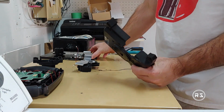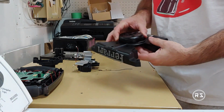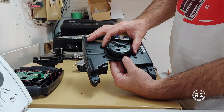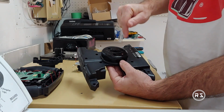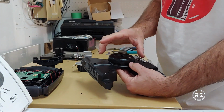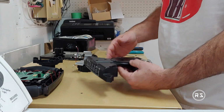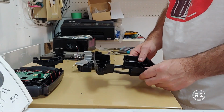And I made another part which will go outside, and as you can see, around the rim there are two flat spots, and this second piece will go like that, and it will squeeze the back of the wheel together, so it will be very tight on the cover, and I won't be scared to break anything or to break the plastic, because the two pieces of wood will be screwed together and not just screwed into the plastic. So I'm getting ready to assemble it.